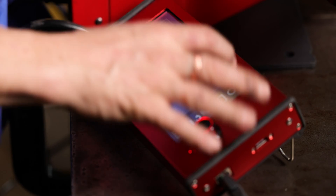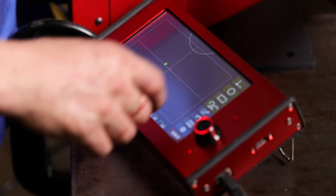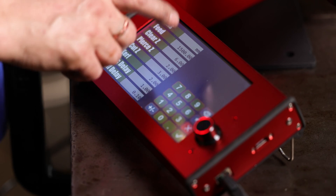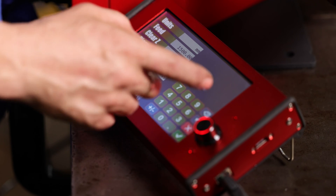So you simply go into trace mode. I like to do just a circle — doesn't need to be anything special. I've got a 10 millimeter circle. But the important thing is in your settings, you want the clearance height to be the thickness of your block. In this case, I've got it set for six millimeters.